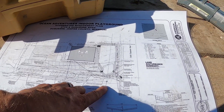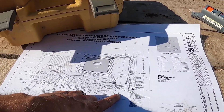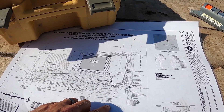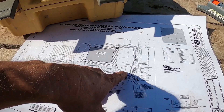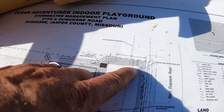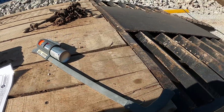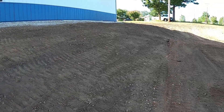Basically mine isn't going to be the exact same number. I've got my laser set up over there, and I'll put the stick and the receiver on the sewer lid and whatever that number is, is my benchmark. Like I said, whatever my number is, we just know that this is two tenths lower, and then this section goes up by a foot, and then every three feet you go over you go up a foot. So you could measure up three feet and you go up another foot, then you go three feet from there and be another foot, and so on — that's what they call a three-to-one slope.